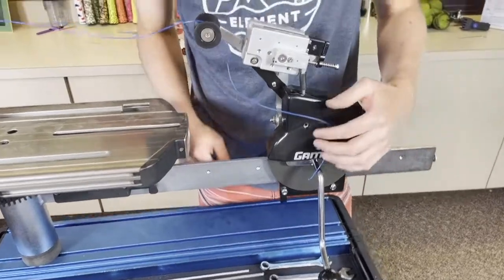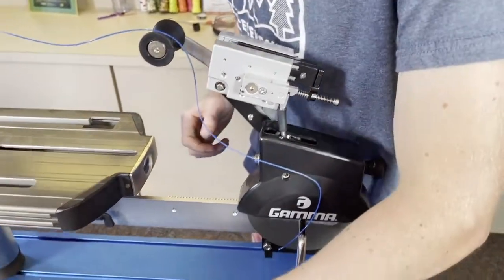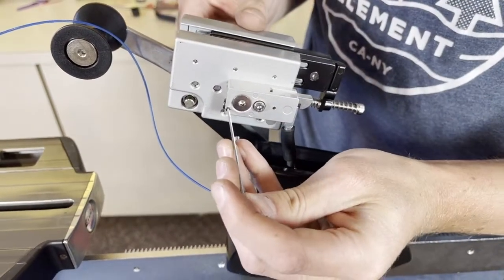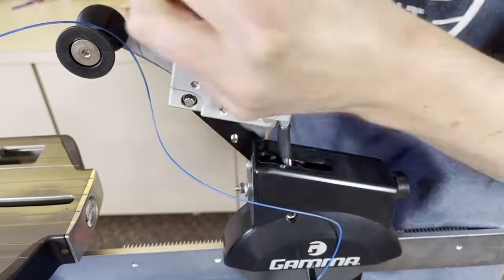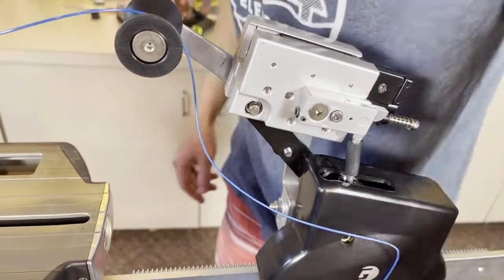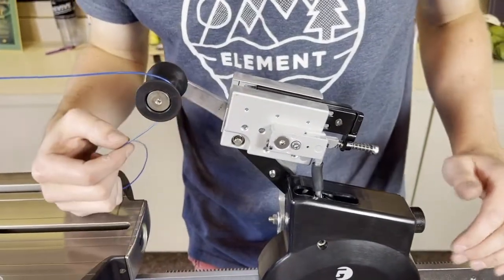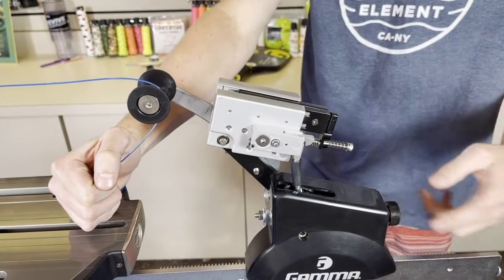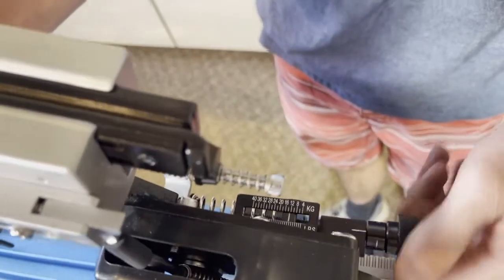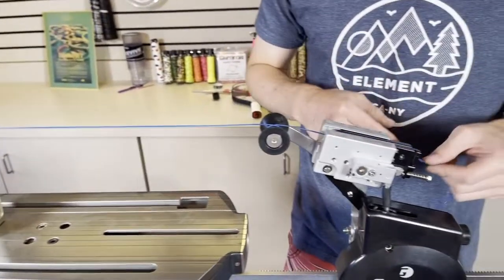To start I'll get into some of the basics. As many of you who own one of these may know, the calibration on these spring tensioners is done primarily on this little brake lever latch block right here. The first thing that you do is loosen the set screw so that you can adjust the main calibration screw on the other side. I've purposely uncalibrated this tensioner so I can do a nice rundown. The first thing you want to do is set your tensioner to 30 pounds — you do it at a low and a high setting. I always start on the low, so there's 30 pounds, and I have my tension calibrator ready.